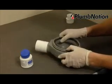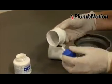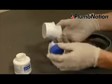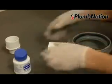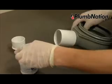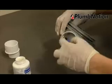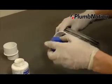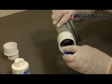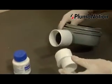The pipe moulded to the trap is a 2-inch standard solvent pipe and has a built-in 3-degree fall. Firstly, you need to fit the 2-inch solvent connector to the trap in order to then connect to the rest of your waste pipe. We also supply in the kit a 2-inch to 1.5-inch reducer should you need to connect to a 1.5-inch waste pipe. You must bear in mind, however, that reducing the waste pipe to 1.5 inches from 2 inches will reduce the maximum flow rates of the drain from approximately 60 litres to 45 litres per minute.